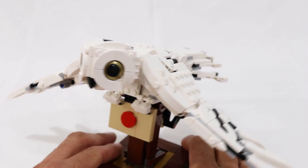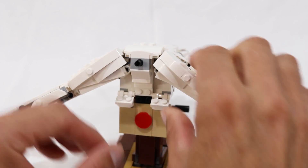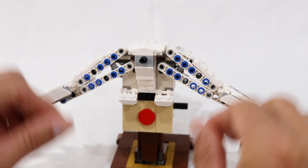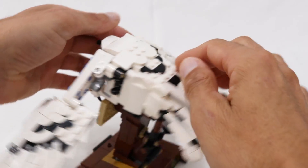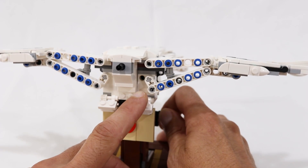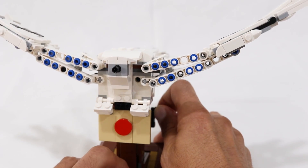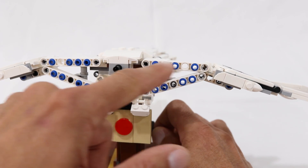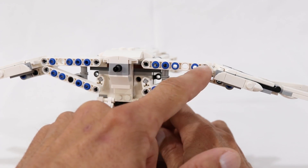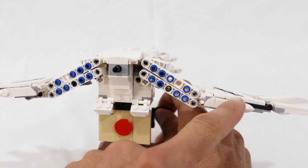On to my modifications, which are actually pretty minimal. First we'll take off some of the decorative pieces so we can get to the mechanism. There is a crank at the base of each wing which drives all the movement through a pretty simple set of linkages. The upper lift arm is anchored at the shoulder, and the change in relative position between these two lift arms causes this section of the wing to tilt.